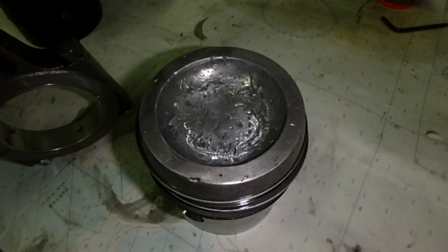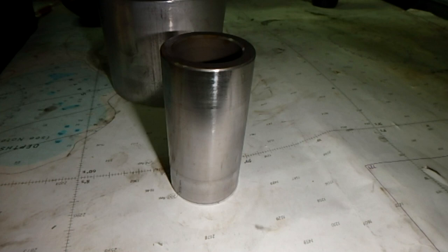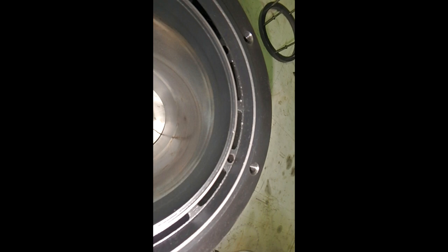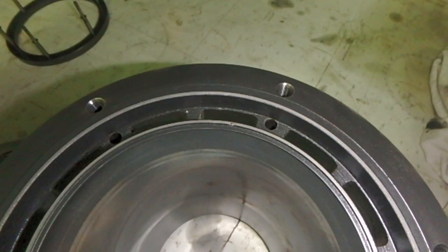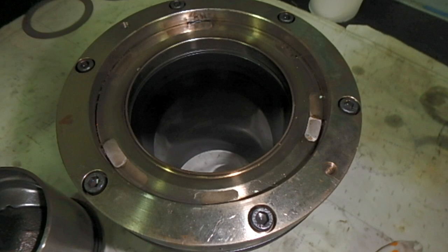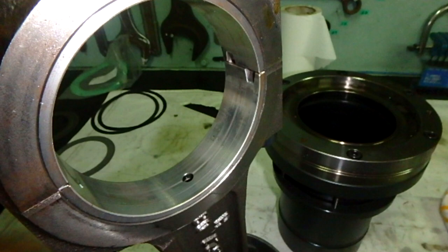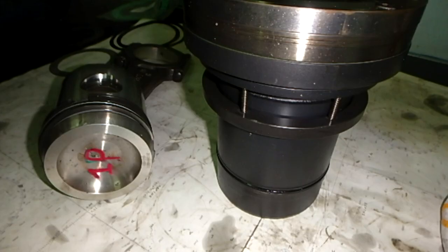What we do first is we set the packing, we set the O-rings, we close the covers, and then we make a vacuum inside our compressor. We have made a vacuum, so there is no air inside our air condition plant and our compressor. And the next step, because we have a vacuum inside, we can fill the oil. We can feed the oil through a special pump. There is a special pump, a high pressure pump, manual by hand. We will fill the oil inside, and then we can open the valves so the freon from the system will enter this compressor.